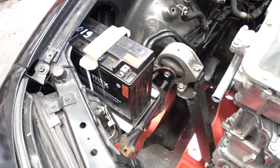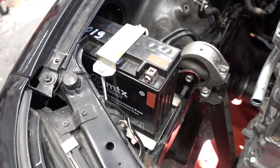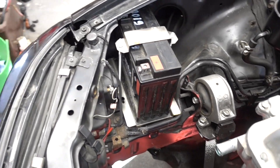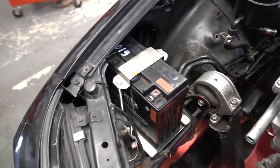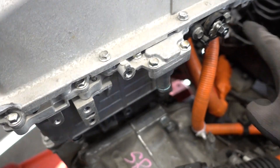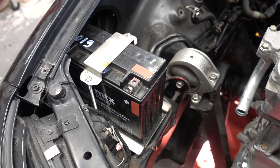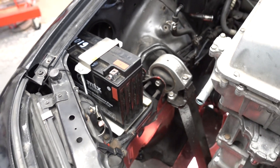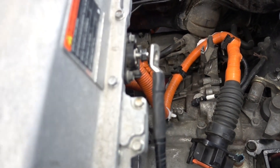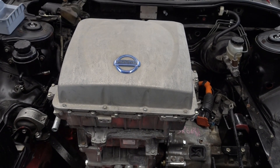The PDM part is done, so now we move on to the 12-volt side of things. Here is a 12-volt lead-acid battery we took from a lawnmower because it was quite small and fits perfectly in this space. All that's needed is to connect this 12-volt side to the PDM — this is the 12-volt output, and this is where you also ground the PDM, which goes to the 12-volt battery negative. I've already started with the same style of crimped cables here.